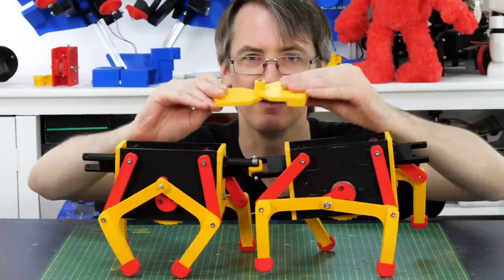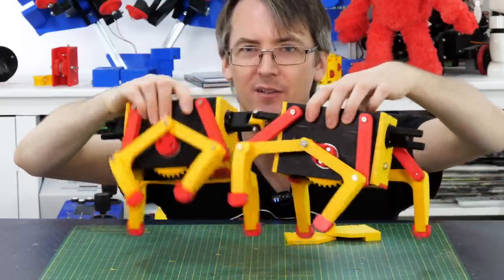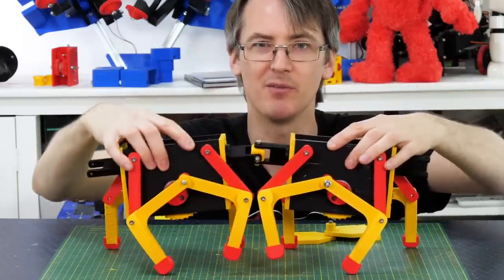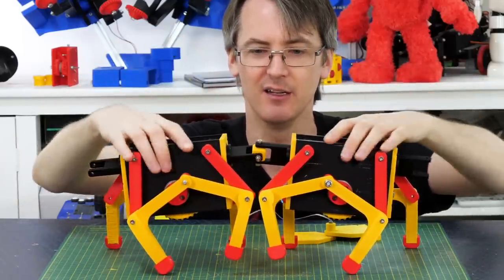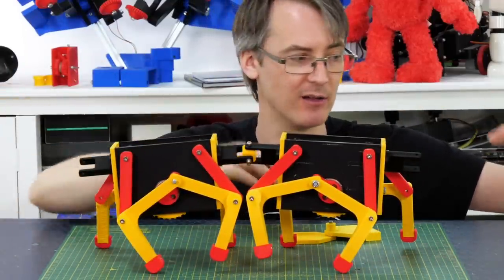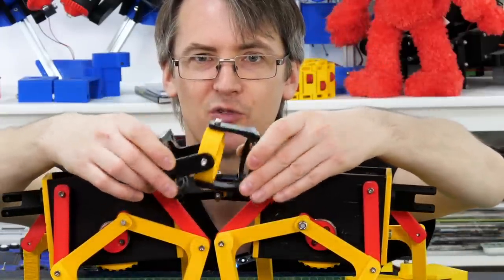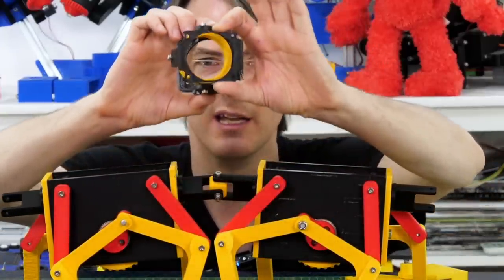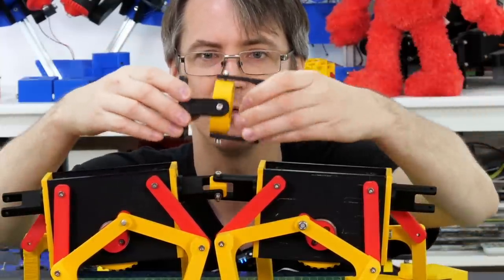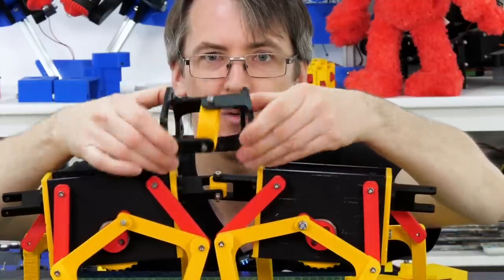This fix means it can only move in one axis — it can't move up and down or twist. I think this twisting is what was causing the problems, however I do want it to be able to move up and down since there are going to be five sections together. So we're going to use another piece between the body sections — another universal joint with a hole in the middle — so that the existing drive universal joint can fit right through the middle, but this outer one is attached to the bodies so it can only move left and right and up and down with no twist.